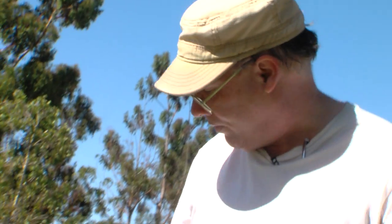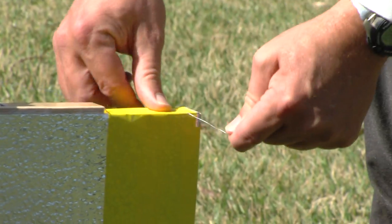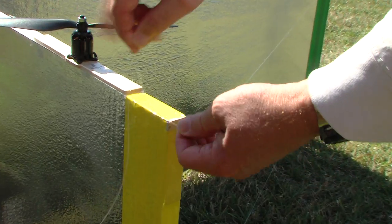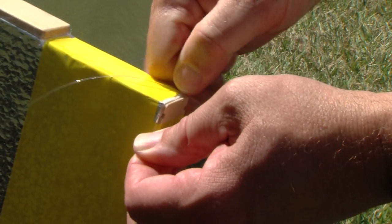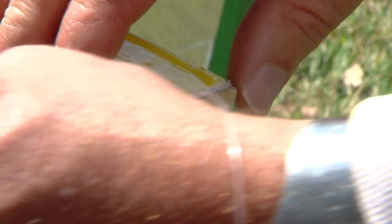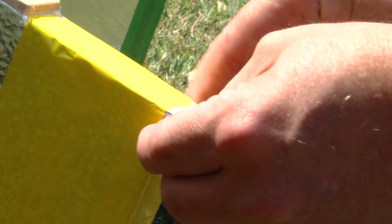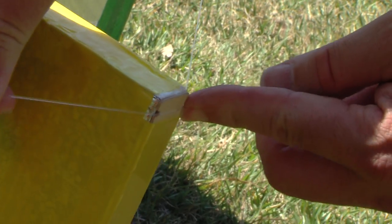The way this works is really super easy. At each one of these tips there's a little plywood plate with little notches in it. The monofilament line simply wraps around the plate — it goes this way around the plate and then slips in behind the plate. Notice how the plate isn't taped down at the top. You pull the loop tight and that's how it attaches.